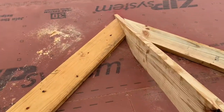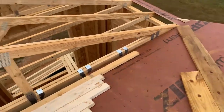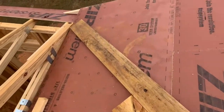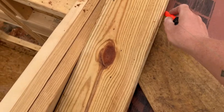You may be asking yourself: how the heck do you find the angle that you need? I just use other boards and scribe. I'll show you what I mean by scribe — I take a board like this, put it along there wherever I want to find an angle, and run my pencil right along.